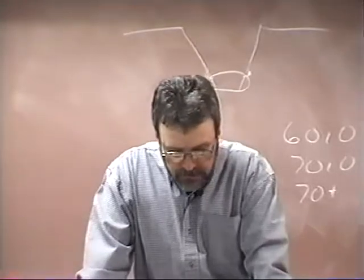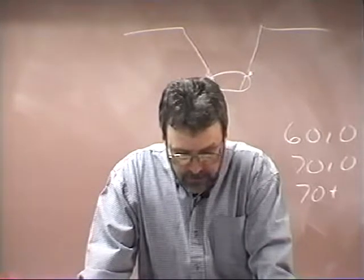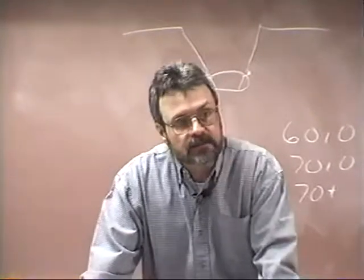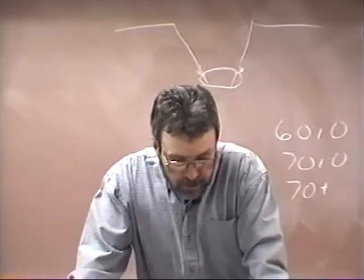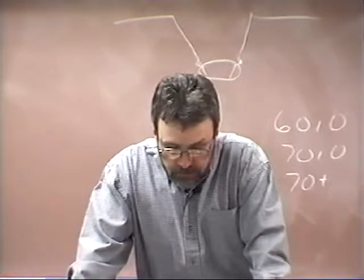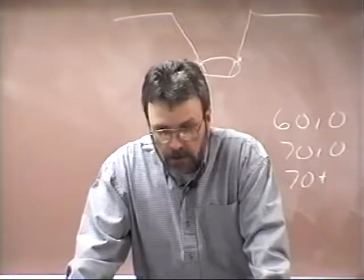The primary objective of the second pass, called the hot pass, in downhill pipe welding, is to burn out the remaining slag and to complete the edge fusion between the root and the base metal. So again, you can actually sometimes think of it as a continuation of the root bead. Only a small amount of metal is added by this pass. As mentioned earlier in this chapter, the weld joint should be warm when this pass and all subsequent passes are deposited. The remaining passes should be made as soon as possible after previous passes have been completed.